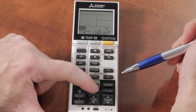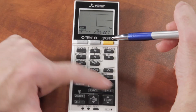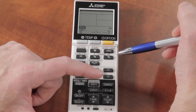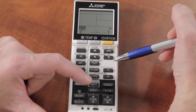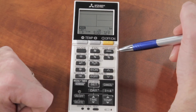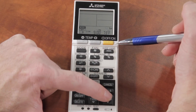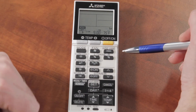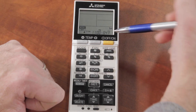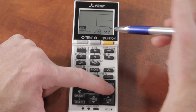I want to do the same thing for Sunday, so I move the day to Sunday. I have the six o'clock program set and I'll delete number two. I can also change a setting — on Sundays my mother-in-law comes over in the evening and she likes it a bit warmer, so on program three I'll put that up to 75 degrees. Then at program four, 11 o'clock, it goes back down to 64 degrees for sleeping. So now I have a different program for Sunday than for Saturday.